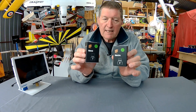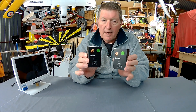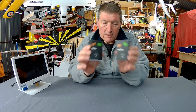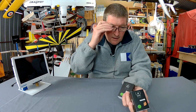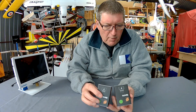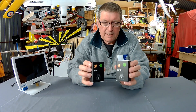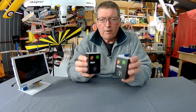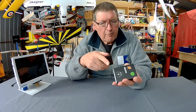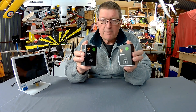Two little 4:3 aspect ratio FPV cameras, both CMOS sensor, 1000 TV line. You can choose NTSC or PAL when you buy them — it's not switchable as far as I know. Input voltage is 4.8 to 36 volts, nice wide input voltage. 2.1mm lens, on screen display, voltage displayed on screen with both of them — with all these cameras actually. Wide dynamic range, low voltage alarm, all the good stuff we expect from decent cameras these days.